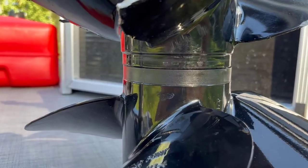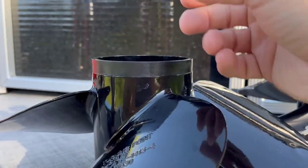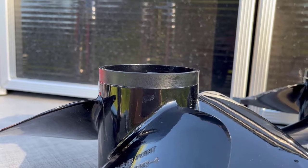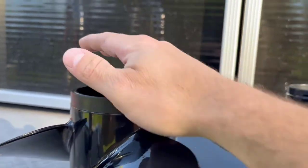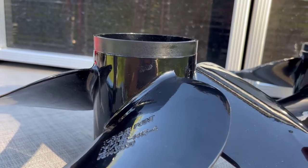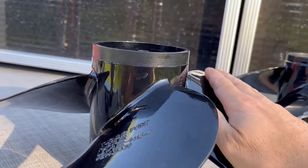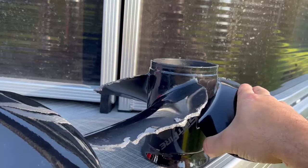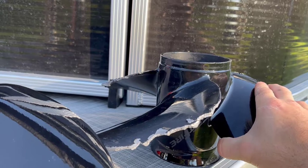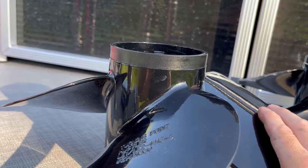Note the adapter on here as well — you can see this plastic adapter around the top. That makes sure this prop, which can be used on this Mercury engine, is going to be the same dimensions as the Spitfire OEM prop. If I didn't have that adapter on there, it would actually be narrower, and that would potentially allow exhaust from the engine to wash out, creating bubbles. Those bubbles would mean my blades themselves were not able to grip the water and cup and shoot that water out. So that adapter takes up the space that's taken up on the OEM Spitfire prop. This aftermarket unit was available and is a fraction of the cost — I paid roughly $160 Canadian versus something like $300 for the Mercury OEM kit.